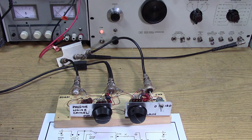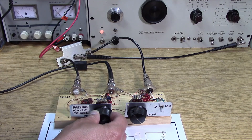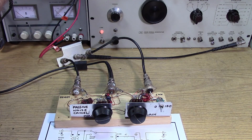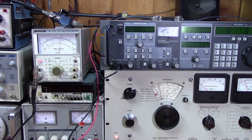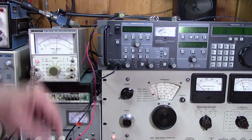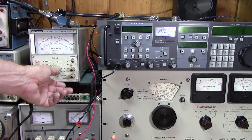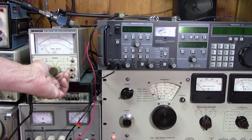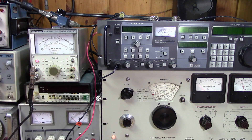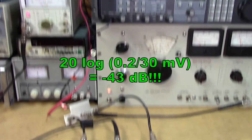Okay, there's already been a drop. Let's get a look at that — that's over 20 dB. Let me show you this on the meter. This is the kind of null we're getting. We started at 30 right here. Absolutely amazing — working very well in the broadcast band, this passive noise canceler.